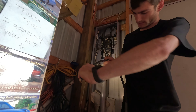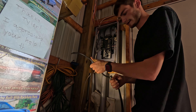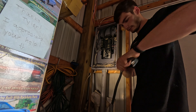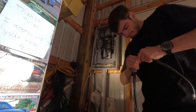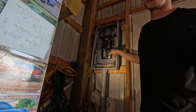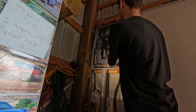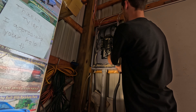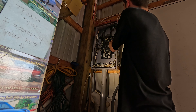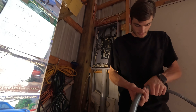We may have just too much wire. Go right here and up here, maybe a little bit more. Remember we still have to ground to this bar right here, so that should be plenty. We'll slide this up here — seal tight — get the lock nut on here. This lock ring sits on there, crank it down.